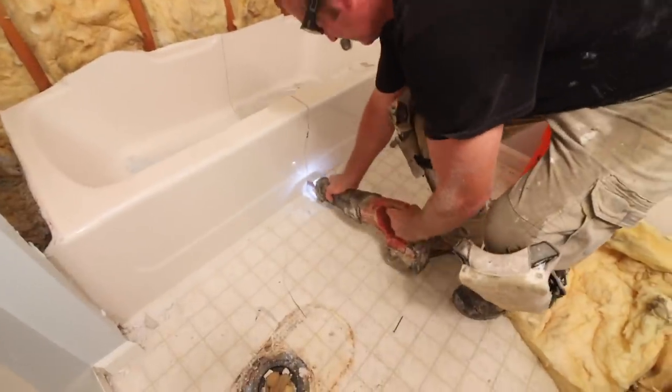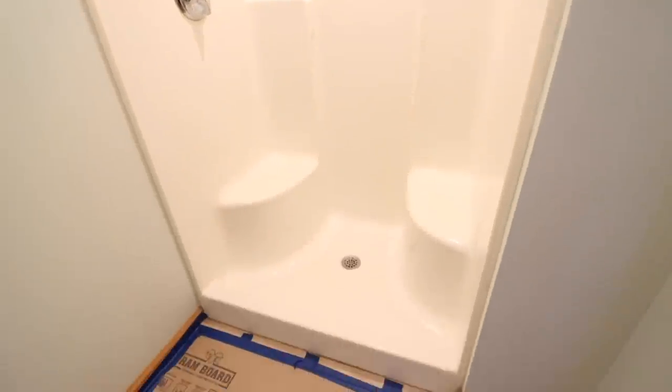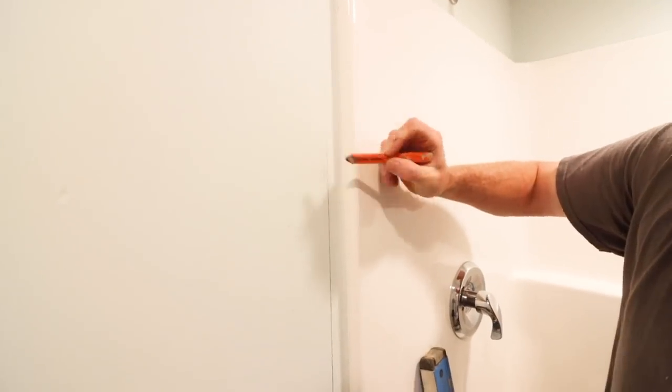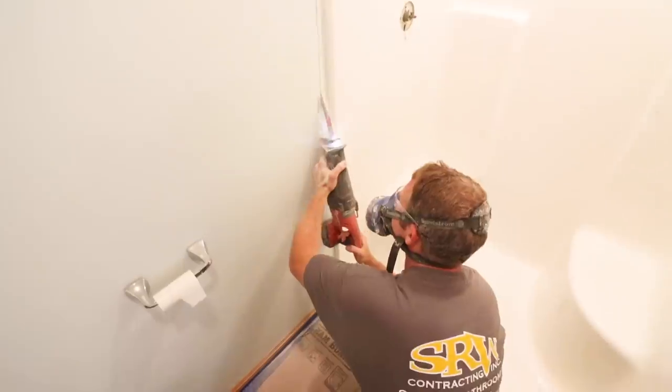You can also cut the tub in half to make the removal so much easier. Another common configuration in a bathroom is a one-piece stand-up shower — again, this is a fiberglass unit. You can mark the flange that's going behind your drywall and then remove the escutcheon and the shower head just like you would with a tub.